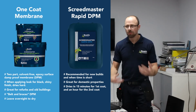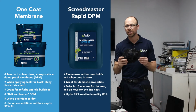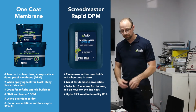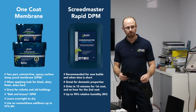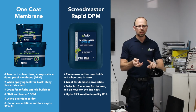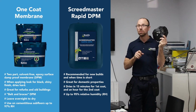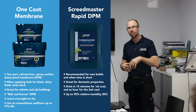So what we'd do is check for moisture. This one could go up to 95% RH. Not as high as the One Coat, but 95 is still blooming high. It's got a really good history out there, and we've done lots of jobs on it, lots of London jobs. One job in London was Canning Town, the Hallsville Quarter development, a combination of hotel, apartments, leisure facilities and shops. All the hotel and all the domestics were done in rapid DPM, because the RH levels were right for it, below 95.